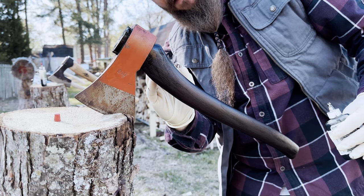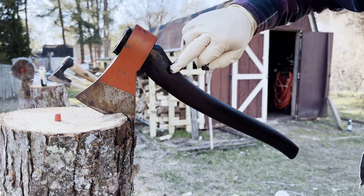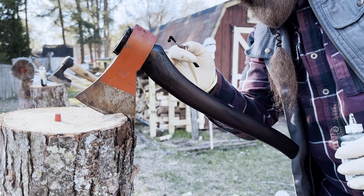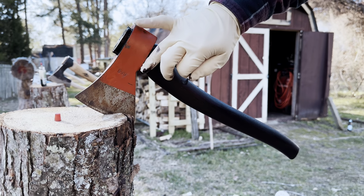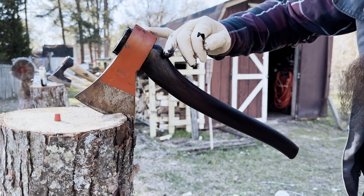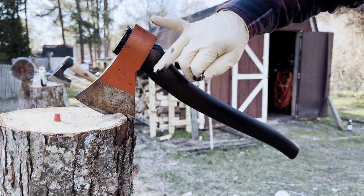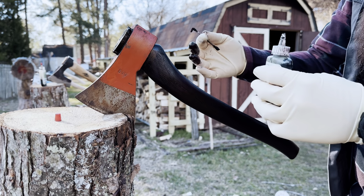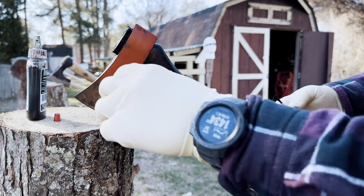Also, if you have any dye that's pulled up, you want to rub it in a little bit. If not, it'll take longer to dry and then you'll get a little bit of a darker shade. You want to try to get a uniform shade if you can in this part here, so that way it goes on better. If you let it dry and then go back on with some more, it will change the shade of the color. So try to get it all right now while it's still wet. But that's the German throwing axe. And we'll move on to the next one.